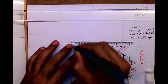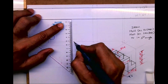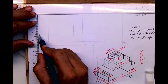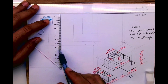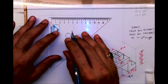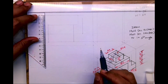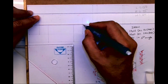I'm marking distance 45 and 45 on both sides. Initially I'm drawing with pencil because I'm not sure how dark it will be — whatever I'm sure will be dark, I'll draw dark; the rest will be light, because in half section you remove certain parts. This height is 25, then it is given 40, so you take 40 and 40.